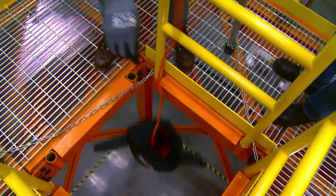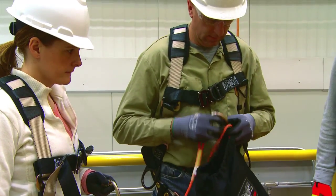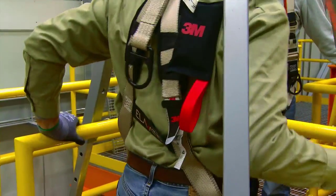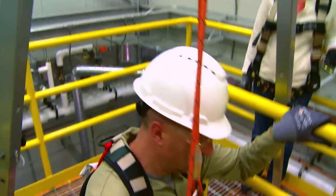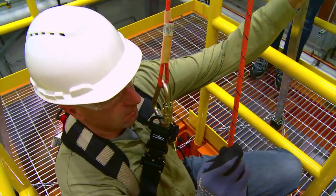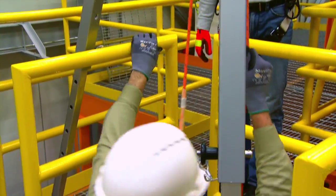Using the attached connector, connect the rope end coming from the 3M and DEUS 3000 series controlled descent device to the first person's harness. Move to the point of egress. Make sure there is no slack in the system. Carefully manage the transition from unloaded to loaded rope so as not to impact load the rope or the descent device.